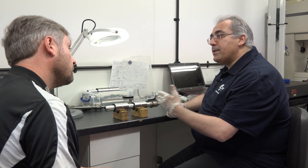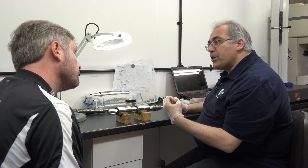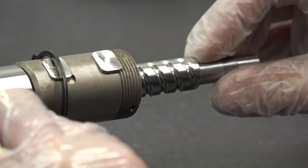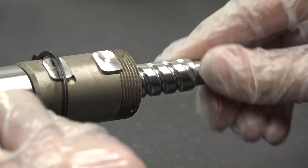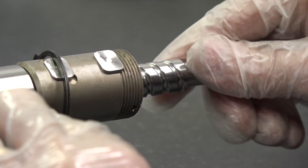With a mirror finish it reduces the friction just a little bit, so we can put a very stiff preload on the ball screw but it actually moves quite easily — so with a very low torque motor.